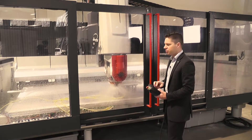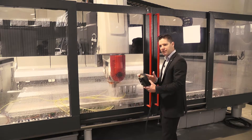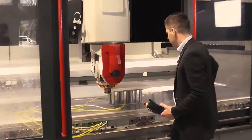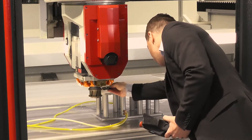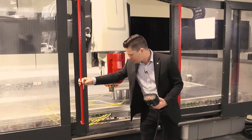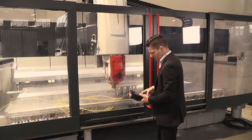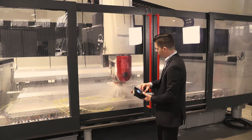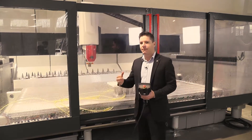Coming up to position two — this is running at 500 inches a minute, so we definitely want to slow it down at the very front and then increase the feed rate. I'll grab the credit card again and verify that my lineup is approximately right, making sure it's going to come into the diamond on both the top and the bottom. Back down to zero for the feed rate. Once I get my rotation at 100 percent I know I'm good to go, and I'll ease it in.